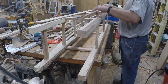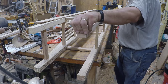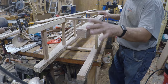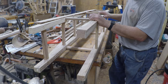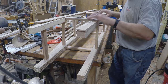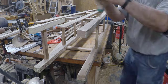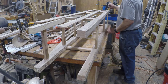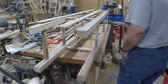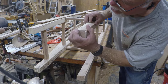Okay, I'm putting on the final trim pieces, and I'm not sure all of them I have are the right length. The ones that are going to be in the back, I'm going to trim up and just piece together. I know I'm not building fine furniture, this is a display, and that will be behind the scenes, so to speak, so I'm not super worried about it. Instead of clamping these, I'm going to hit them on with brads. Again, I'm going to put these on, and then I will trim them off with my flush trim bit.